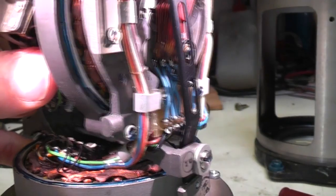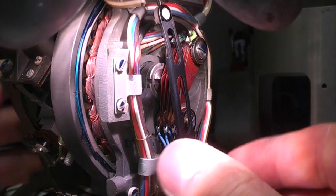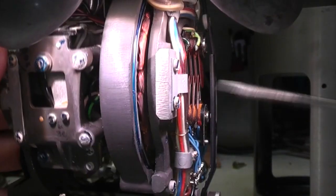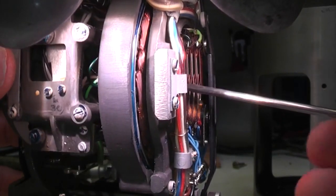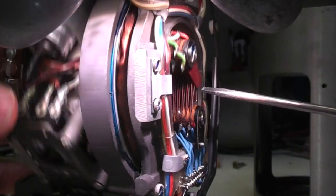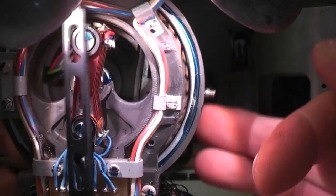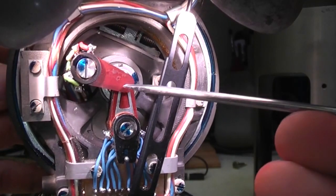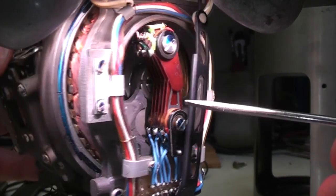The other thing we've got here is another interesting thing on this axis. Again, similar to the slip rings on this axis, this has actually got just a set of point contacts, rotating contacts, because this one doesn't rotate the full 360, so it doesn't need slip rings. So it's easier to have something which makes the contact along the centre line, so there's a fairly small amount of friction and rubbing, whereas this axis rotates continuously.